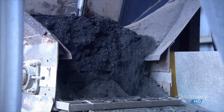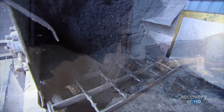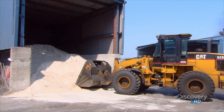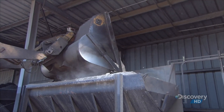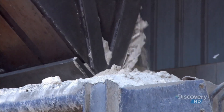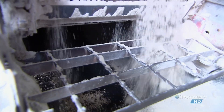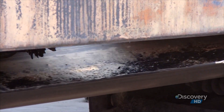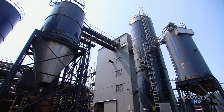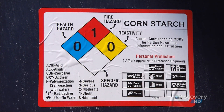Anthracite coal is coal that burns at a high temperature. They also mix in lime — lime makes the briquettes turn white after they're ignited, a visual indication that they're ready to cook on. The mix, now blackened, passes under a second electromagnet to remove any metal that could damage the downstream equipment. Finally, workers blend in cornstarch, which binds the ingredients together.